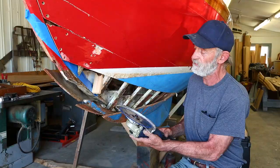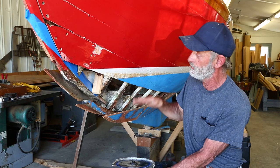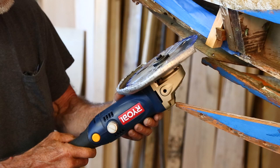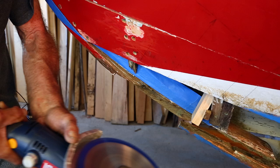It's just a grinder with a skill saw blade in it, and you've seen me use it before. There's pretty much no other tool that'll work for this, because a skill saw's table will get in the way of the frames and the plank up here - that isn't going to work in either direction. A reciprocating saw like a Sawzall will just vibrate everything and they're not really made to cut like a cross cut saw. So I've shifted my saw horse into position so I can stand on it and lean my shoulder against the stem to stabilize myself as I make the cut. I'm not recommending everybody use these things, but it's great for me - let's get going.